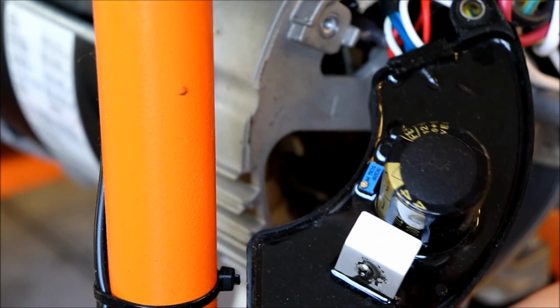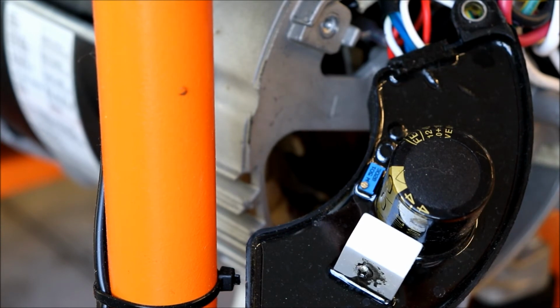So I did check just to see what our actual line voltage is coming from the utility, and we got 122 out in the shop here. So if the voltage was high, I can't see how that would hurt anything because our voltage coming in from the power pole is 122 or so. The hertz though from the wall, from the utility, is right at 60, so we definitely need to adjust on this, that this is a little high.